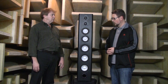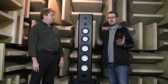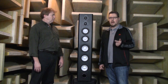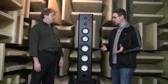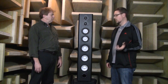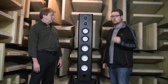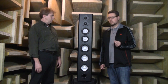When you take a subwoofer out of the equation, extension — and linear extension particularly at very low frequencies — becomes something you're looking for. You also need good dynamic capability at those low frequencies to really give you the sense that you've got full bottom end, full frequency range, and you're not losing anything particularly at high levels. So we took our existing drive units and asked: what do we need to do to get this dynamic capability and this extension right to the very bottom end of the usable frequency response?